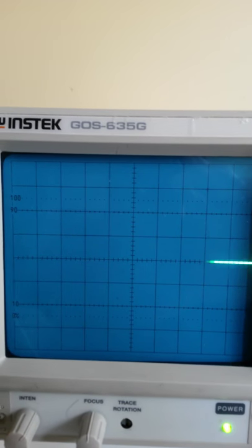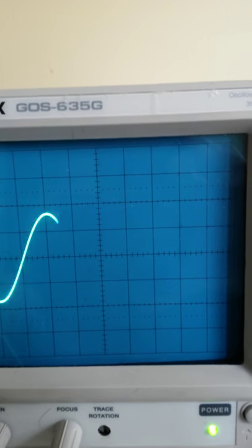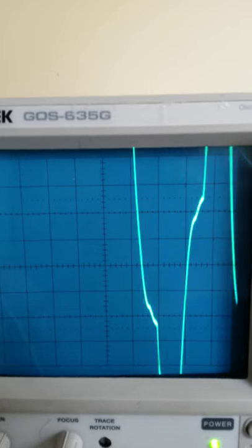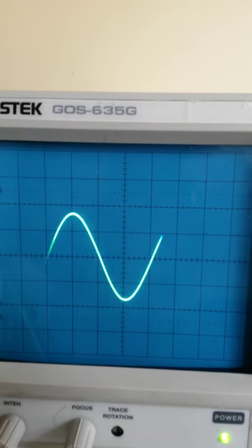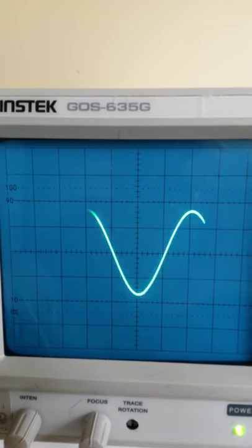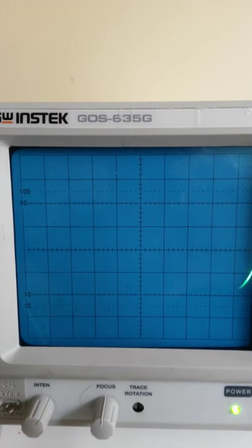If I look at the voltage between line 1 and line 2, there you can see the increase in voltage there between line 1 and line 2. Okay, if I drop it down to the line 2 neutral voltage, there's the line to neutral voltage. That's your phase voltage, and here is our line-to-line voltage. Okay, so you can draw that in on your lab. Nice waveform. Everything looks nice and smooth.